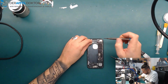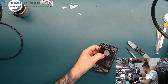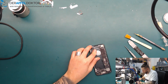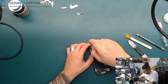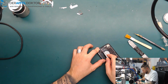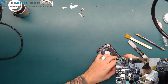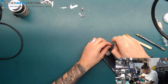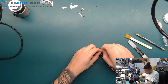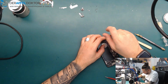I really like them, saltwater damages so much. Perhaps we need to do a swap here. But let's see, what about the logic board? Because often, okay, here a screw is already missing. Often damages like this look so bad, and then it's no problem to get the data without swapping the board. But in some cases, it's just time wasting to search on those boards, so just swap the board, get the data and done.